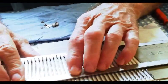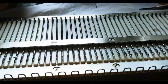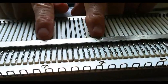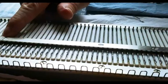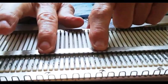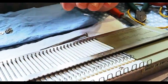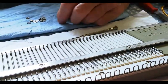My suggestion from working on many different machines: always start in the center and work out, doing a snug fit with the screws and nuts, then come back and tighten everything up. Notice these two center screws are really close together, then there's a big gap to either side for the next ones. So you start here with the short distance that won't bow, snug those two, then go all the way to the ends and snug them, then go back and torque them down. All engine block heads are done that way.